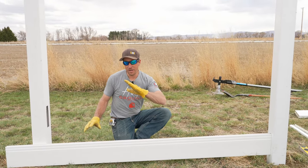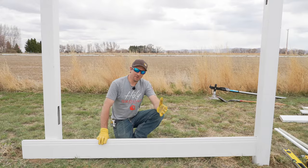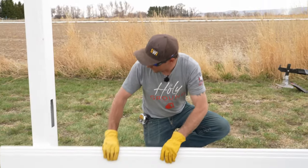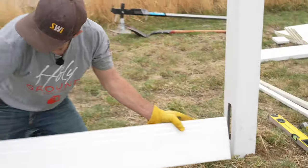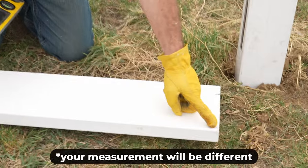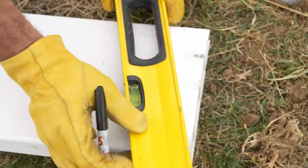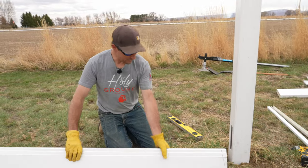If you're going up an incline, each post should be out of the ground roughly the same amount to replicate the terrain. First things first — we're going to find the angle the easy way. We need to go from the inch-and-a-quarter mark down to the factory end at the bottom of the rail, just roughly finding that angle so the rail is going to fit in there.